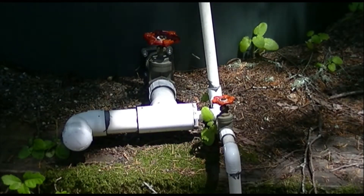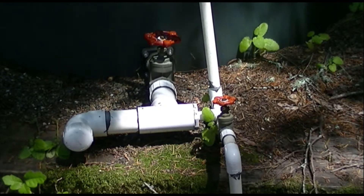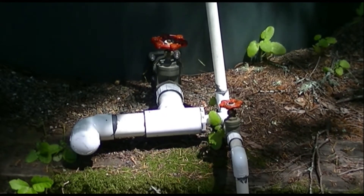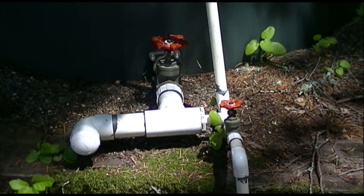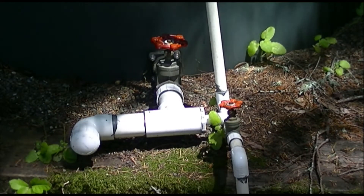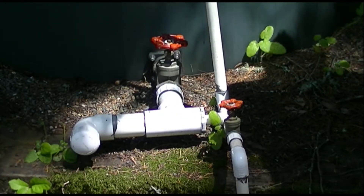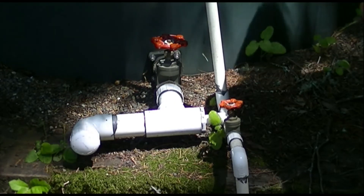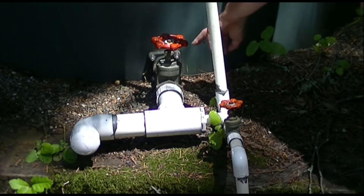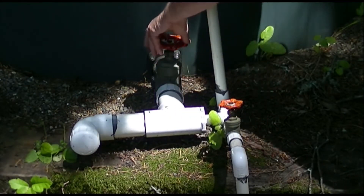Let's take a look at the plumbing for this tank. It's very simple, but understanding how it works helps a little bit. There's an inch and a half or two inch threaded nipple going into this connector that comes with the tank, and there's a shutoff valve.